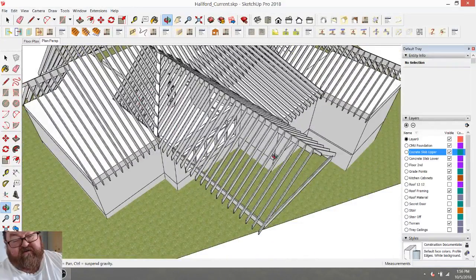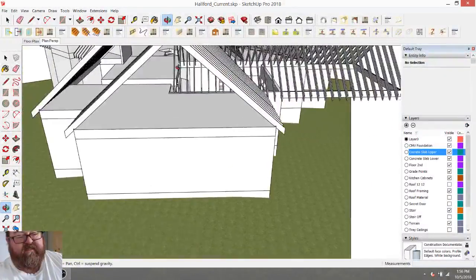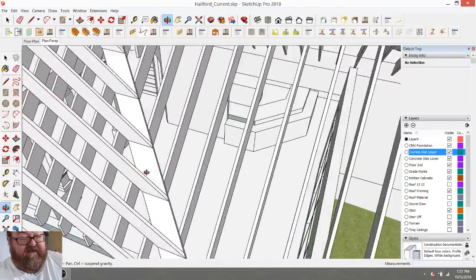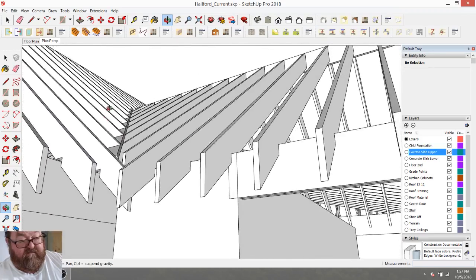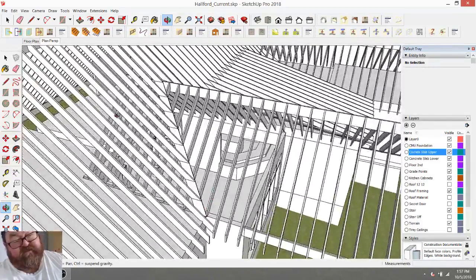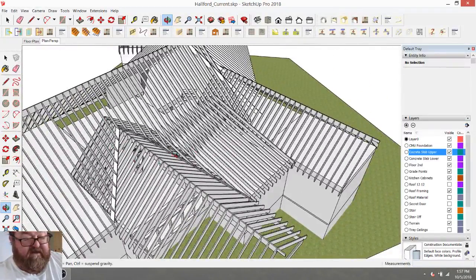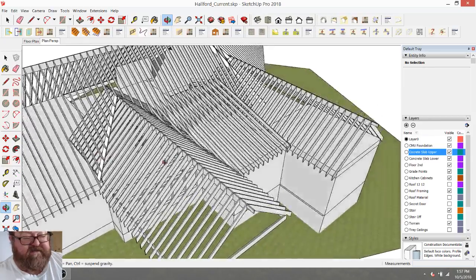But if you'll just make all these common rafters and frame this all the way back into here, like that, then you can lay a 2x12 down on the roof, right in the valley. See? And then you can cut these rafters coming this way to sit on top of that roof. And it's kind of a quick and dirty way. Sometimes people will even deck this part of the roof first and kind of stair step it down.